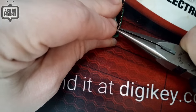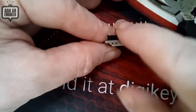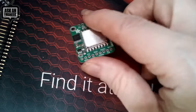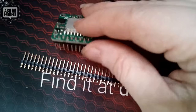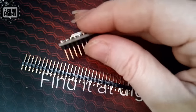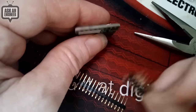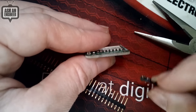You can try to press each pin flat to even them out. As long as you see all the holes coming through, it's good enough — it's actually quite solid. It takes a little effort to get the hang of it, but it does work. You can snap them to any length up to 36 pins. You can also solder them when done for a really solid mechanical connection, or pull them out pin by pin. Afterwards, use a multimeter to check continuity and confirm everything is seated properly.